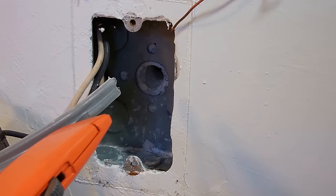You can see with this particular cover, this weatherproof cover that I'm going to be using, this one you have to have the screws partially sticking out to slide them over these oblong holes right here, like that, and push it over before you tighten the screws. The cover is very deep because we're going to have two plugs in here all the time for some low voltage lighting. The wires will be coming out and we'll have this weatherproof cover protecting the GFI from getting wet. Okay, the receptacle is now complete with the weatherproof cover.